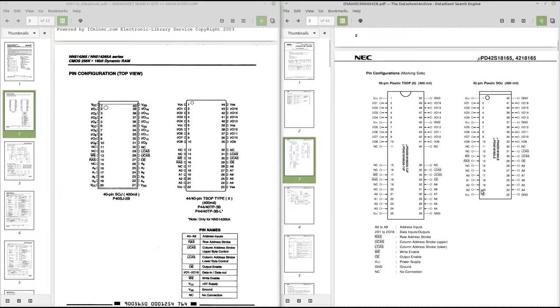On pin 20 here we got an address line, so if we move that resistor, which is located somewhere around here on the board, that will remove VCC from the A3 line, and when we place it in a new position it will reroute this not connected line on a new chip to the pin A3. And the same thing when we move the resistor on the other side: we disconnect ground from A4 and we will connect up A4 to the proper address line. So that's how we get one more address line.